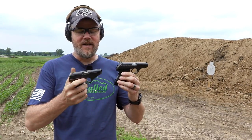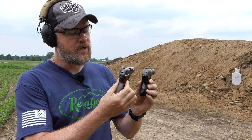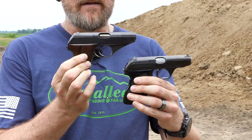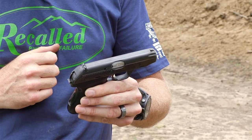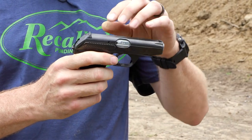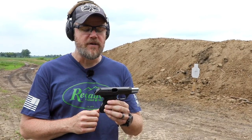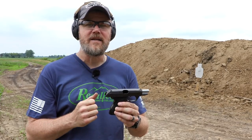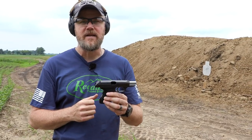There's little doubt that the two handguns are very closely tied. You can see that the hammers in the rear are the same. It has the same magazine safety, magazine slide release — everything. The disassembly is very similar if not identical. You'll notice that the sights are also set into a trough cut in the top of the slide. The little H&K has one extra feature that the Mauser doesn't have. It locks open on the last shot fired just like its counterpart the HSC, however with the HSC there's no way to drop the slide unless you put a magazine into the gun.